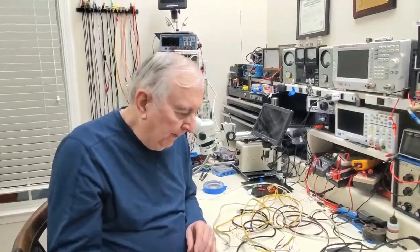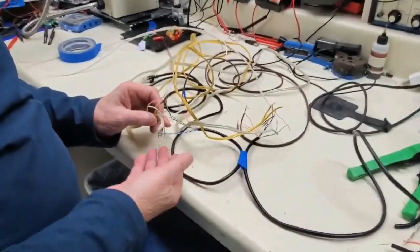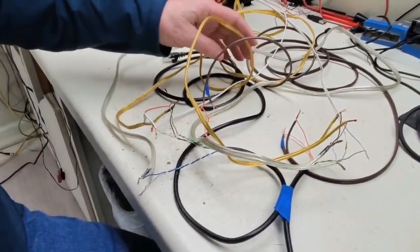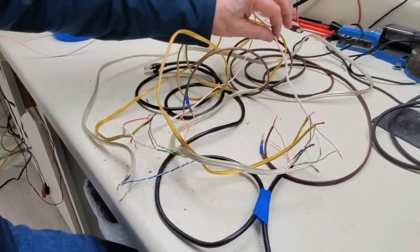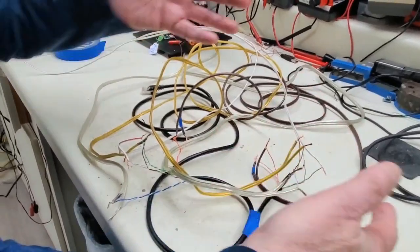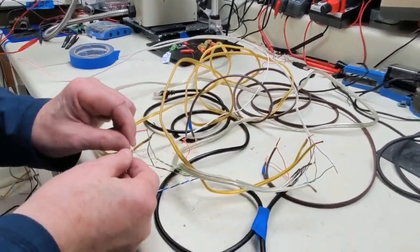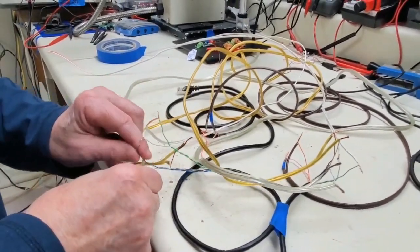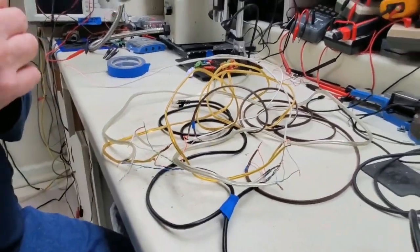Okay, we have spliced all 8 wires of the Cat5 cable, as you can see here, into the various lamp cords, the old lamp cords, new lamp cords, and doorbell wiring. So you can see it looks pretty messy. I'm not going to tape them up. We'll just try to separate them, make sure they're not shorted. Oh, that one's about shorted, so we need to fix that. Okay. So we're going to do a speed test now and see how this works. What do you think?